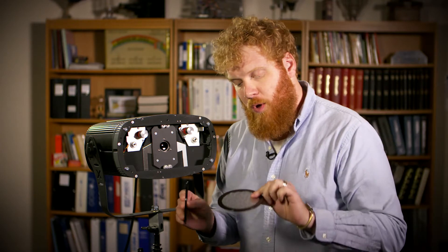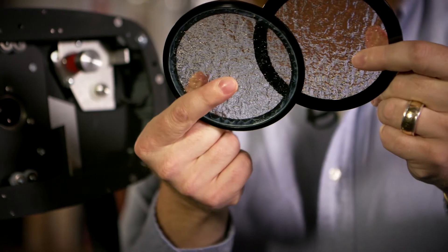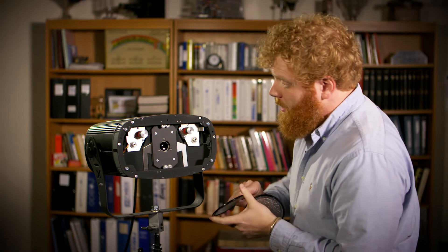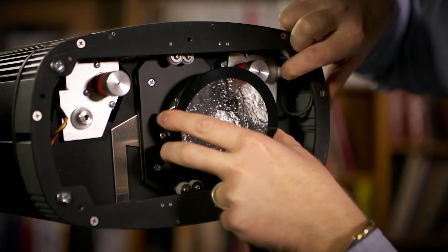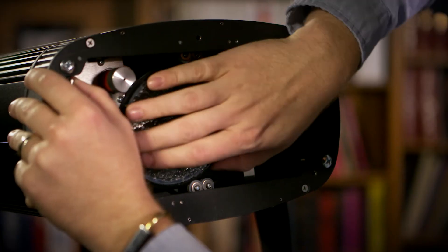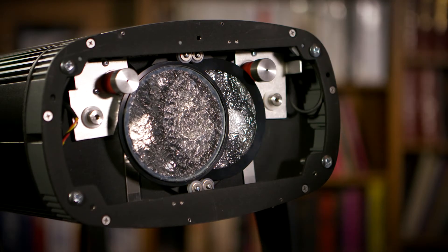When you're putting new gobos in, make sure that the flat side of the bezels face one another. There is a ridged side and a flat side — go flat to flat for smooth operation of the fixture. Find the deeper pulleys and rest the gobo in these idler pulleys, allowing the drive pulley to go into the space here. Repeat that on the other side, overlapping the gobos kind of like the MasterCard logo.